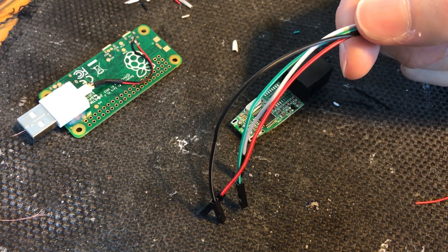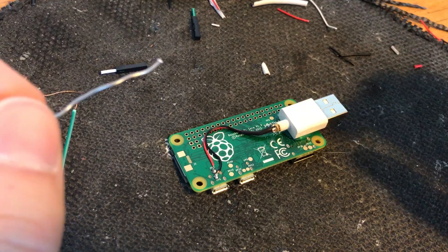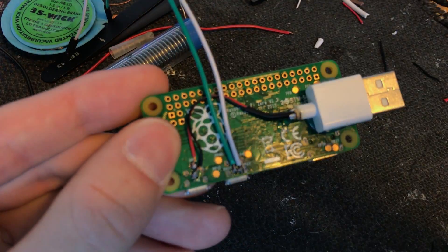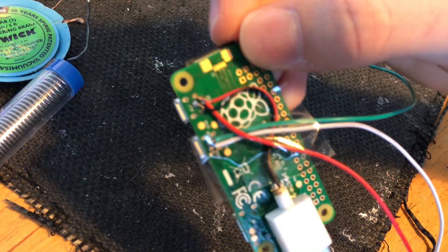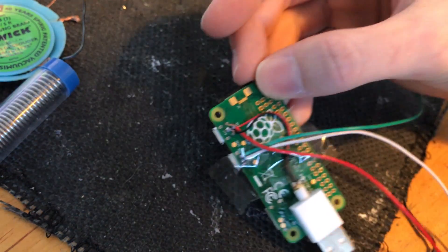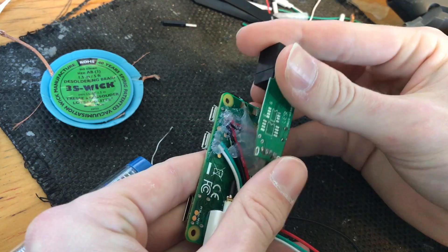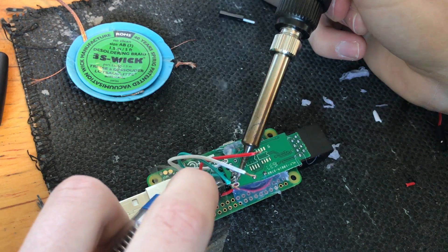Now it's time to connect up the adapter itself. I'm going to use black, green, white, and red wires to connect up the corresponding terminals to the Raspberry Pi. Just like before, I'm going to tin some pads — this time it's the data positive and data negative lines — and then I soldered on the corresponding green and white wires, although my hand was in the way the whole time so there's not really any usable footage of that. Next I soldered the positive and negative wires for the adapter itself, so the two red wires are connected to each other as well as to the pad, and the same goes for the two black wires. After all that soldering, I covered everything with some hot glue to make sure none of the wires would be accidentally pulled off. Then I added more hot glue and held down the adapter on the Pi until the glue had set, cut down and stripped the remaining wires, and used sellotape to hold them in place while I soldered them on.